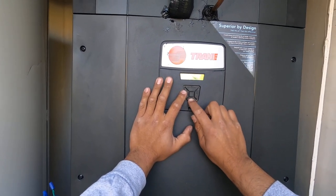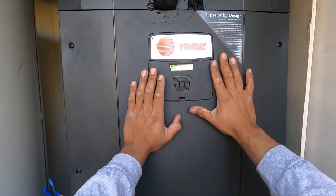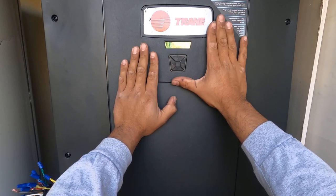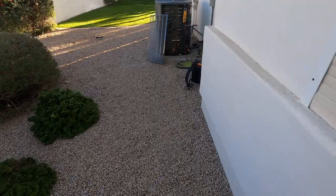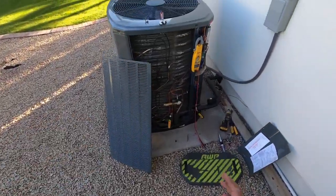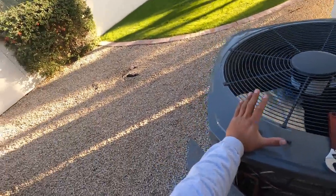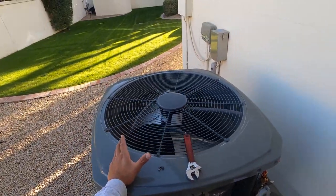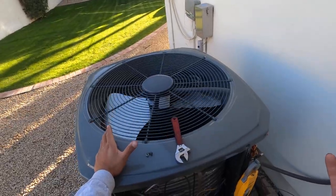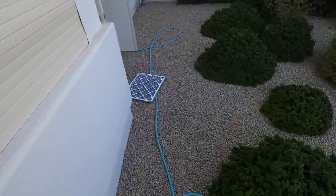When you go to turn it off or continue with going down, it's going to say CDA communication error, which means it's now saving the settings. So it shuts off — okay, it shuts off. Before, it was running and running and running, and that just made my high pressure skyrocket. Then it shut off on high pressure after about 30 seconds, maybe a minute max.